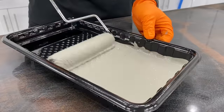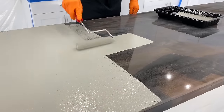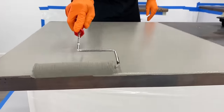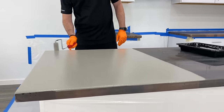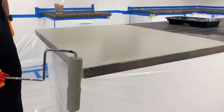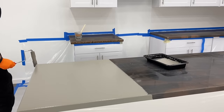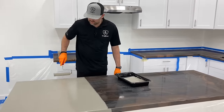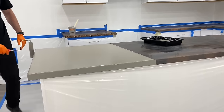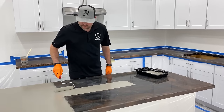Just soak the roller for a minute, do a pass down the middle, then cross roll. This is a fast-cure primer — it's going to dry really fast and you need to apply your epoxy over this within two hours. If you can't apply the epoxy within two hours, you probably shouldn't prime your counters. If you wait past that, it's basically a sealed surface and you'll need to scuff it or do a denatured alcohol wipe to tack it up. It's made to go on thin — just roll it out quick, look for thick spots, roller lines, and make sure edges and corners are all hit.